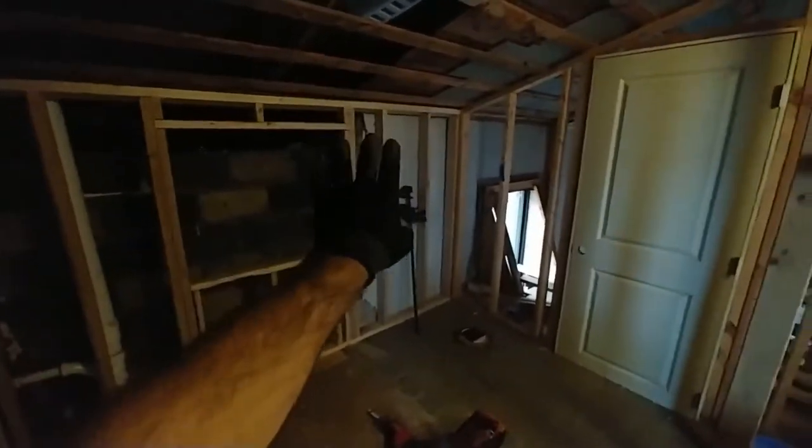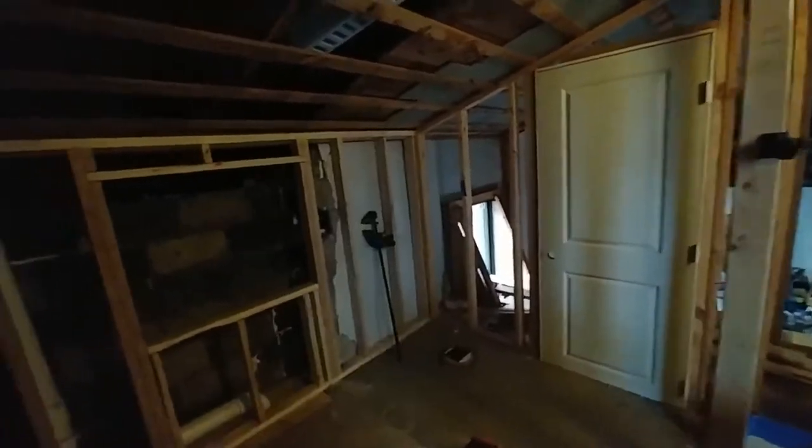And this opening is for three cabinets. It's a 36 by 30, and my buddy bought three 1-foot wide cabinets that are 30 inches tall from IKEA, and we'll just 1, 2, 3 mull them together, face frame mull, and maybe you have to add a little sliver between them, like Luon or something, to hold them square, and then slide the group in after the drywall's on, and the face frame should trim them out well enough, and then you could trim it further after that.